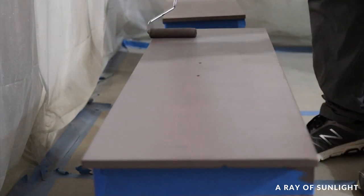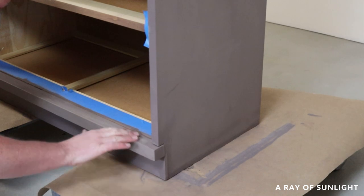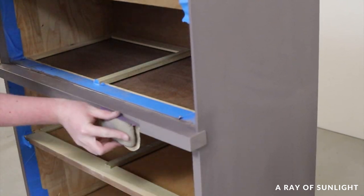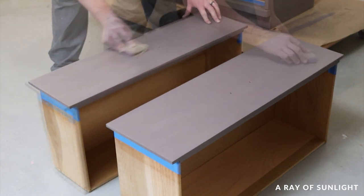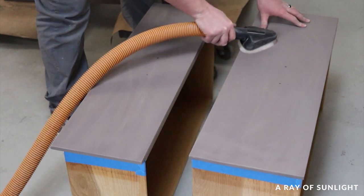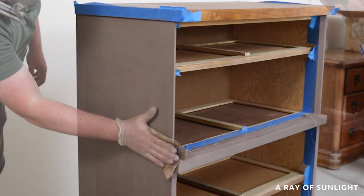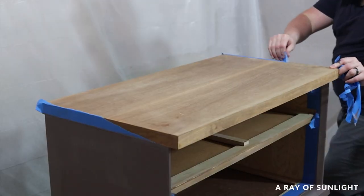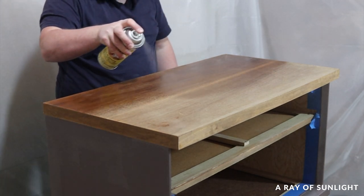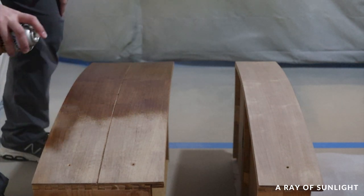There was still a little bit of texture, but definitely not as much as before. This time when I sanded the texture down, I sanded by hand because I was worried I would sand through the primer again. I was able to control how much I sanded so much better than before. I also sprayed clear shellac on the top and the two other drawers that I planned to stain. Natalie said she has heard that it helps the wood stain soak in more evenly, so I thought I would try it.